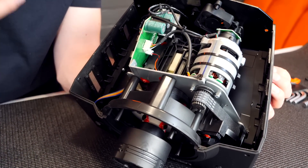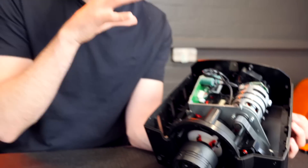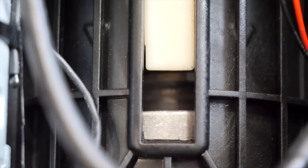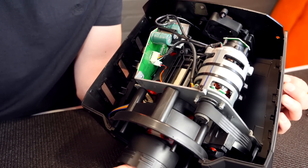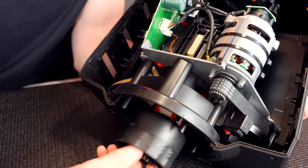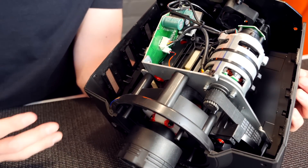As you can imagine, if you're driving with high force feedback, the load going through this part of the wheel base is quite significant. This white material here in the middle is actually a steering lock, as you would normally have in a road car, where you turn fully to the right and it stops, and then turn fully to the left and it stops. It's actually on a screw thread, so you can see it moving as I rotate what is essentially the steering wheel, and then you get to the end and it stops any more rotation.